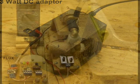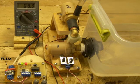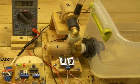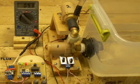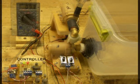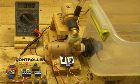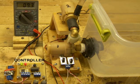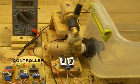In addition to our supply current limitations, we'll further limit the current available with this switch. Toggling the switch right represents a bright sunlight, high current situation. Toggling the switch left represents a low light, low current situation. A differential controller is used to turn the pump on and off. Notice the two knobs towards the bottom of the controller. The knob on the left simulates collector temperature, and the knob on the right simulates storage temperature. By increasing the simulated temperature in the collector, we can turn on the pump.